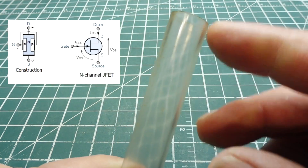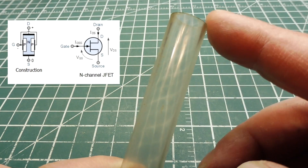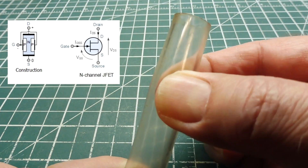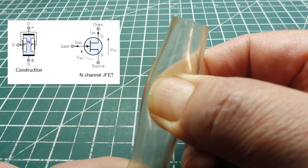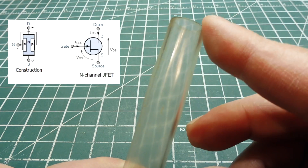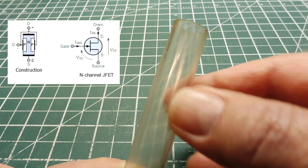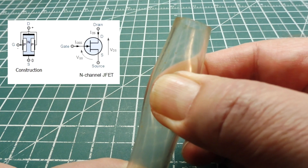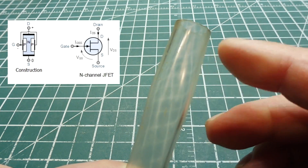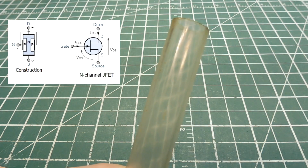This simulates a bar of semiconductor material between the drain and source, and the water represents current flowing through the pipe. When we apply voltage to the gate, we pinch off the pipe and block current flow. When we remove the voltage from the gate, we open up the pipe and get maximum flow. When the gate is shorted to the source we have maximum flow, and when we apply a negative voltage to the gate we pinch off the pipe and the resistance between drain and source increases. We're going to use this depletion-zone N-channel JFET in our Wheatstone bridge.